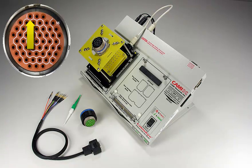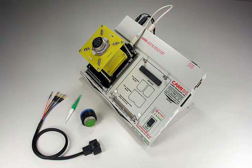Instead of counting forward or backward from reference markers on the connector's rubber grommet to find the insertion point, the operator looks for a bright flashing light projecting from the target cavity. The flashing target is easily distinguished from the surrounding dark cavities, and insertion into the correct cavity is confirmed when the flashing light disappears.